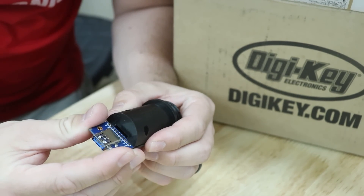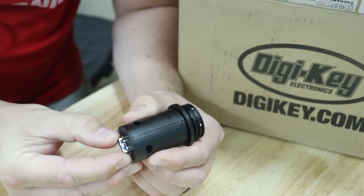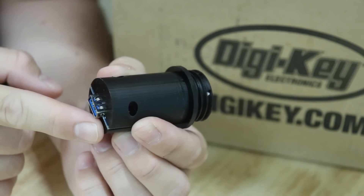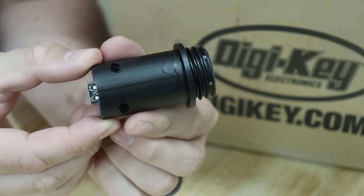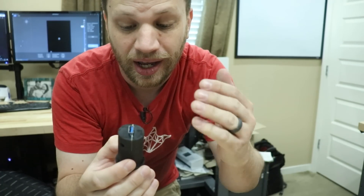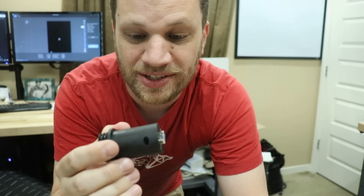Here is the moment of truth — I've got to see if this little USB connector will slide into here. It fits in there but unfortunately it sticks out too far. I didn't cut these slots back far enough. This is like my third or fourth one of these that I've printed — they take like five hours each time. So I think I can just take a Dremel with a cutoff wheel and extend that little slot down a little bit further so that it sits flush and the screws will line up. That's really frustrating but that's how it goes in prototyping.